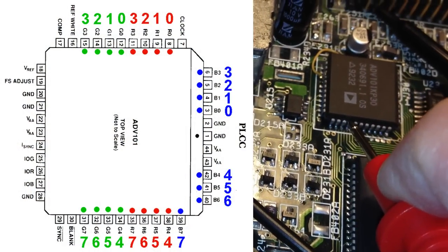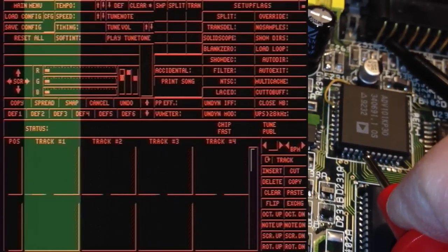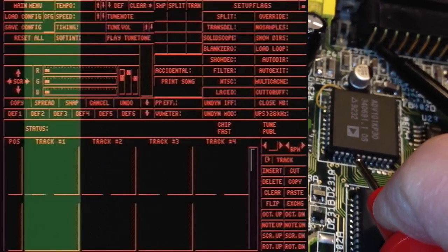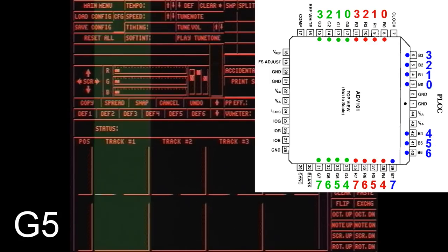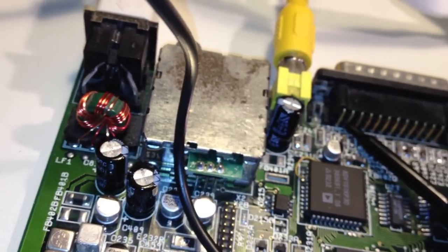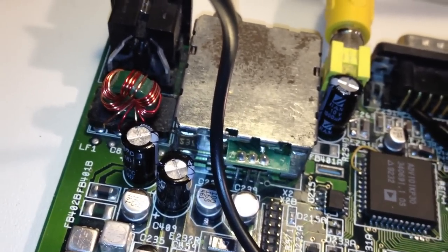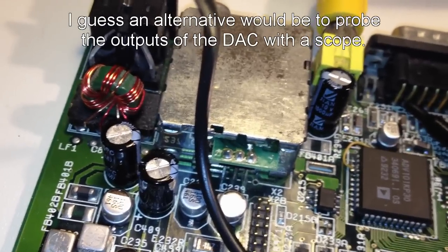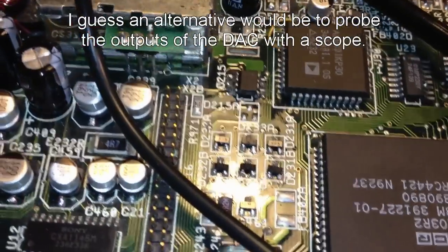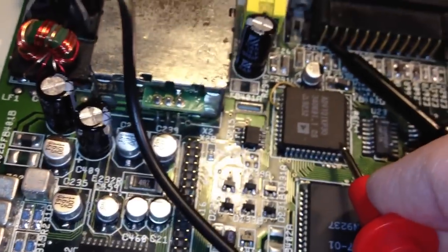Now let's go down to green 6. That was green 7. Let's go to green 6. And we can see that this vertical bar is becoming less intensified. So we're going down in the values here of the data bits. We're going to the less significant values. So if we go down all the way to green 1 or even green 0, which would be the least significant value, then it would be pretty much impossible to see. We would have to tweak the settings on the TV a lot in order to even be able to catch that. And maybe even then it would be really difficult. So let's not do that. But okay, so we can continue with the red here. You know, it's the same thing.